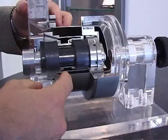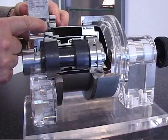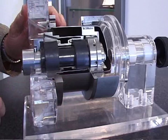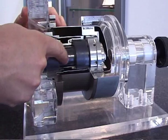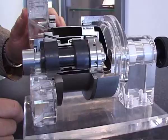In the case of media which also convey gases or contain dissolved gases, circulation in the area of the can may cause this gas to be released and form a sizable bubble, resulting in obstruction of the circulation. If the gas bubble becomes so large that it interrupts the circulation through the bearing arrangement, this will cause damage to the sliding bearings due to dry running and will ultimately damage the pump.